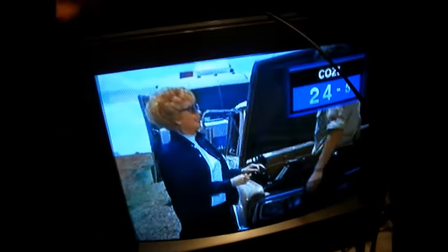I think we're about ready to button this thing up. Now we're going to tweak the grayscale adjustment, and that's accomplished by turning the color all the way down and turning the contrast or picture control down to get a dark picture. Then we'll adjust the red, green, and blue bias potentiometers for the best black and white picture.